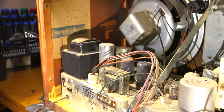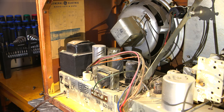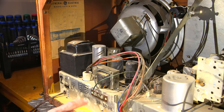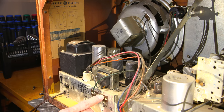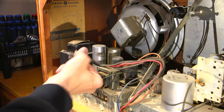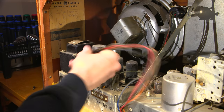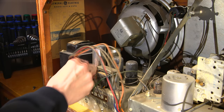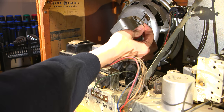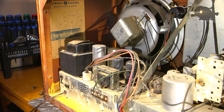These are the output tubes and the transformer. It has a 4 and 8 ohm tap with a common. The chassis are socketed so you can remove them. They really didn't spare any money on this thing — everything is so easy to disassemble. It even looks like you can unplug the speaker. They really thought of everything when they put this together, so it should be relatively easy to remove the chassis.